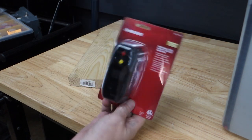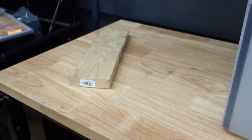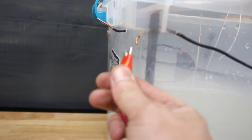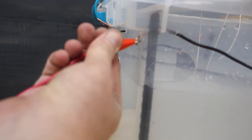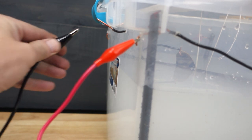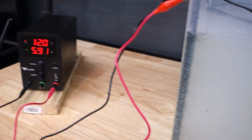I did pick up a GFCI outlet protector — not sure if it would have helped, but working with a bunch of water and a power supply on a bench, it put my mind at ease. Here's the important part: you're going to want to attach your red or positive line to the anodes, which is the string of rebar, and attach the negative to the cathode line, which is connected directly to your pipe. Doing so in the reverse order will cause your pipe to deteriorate, so you want to make sure to get this absolutely right.